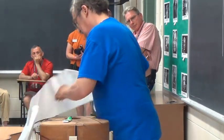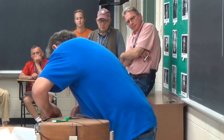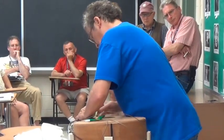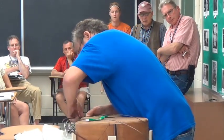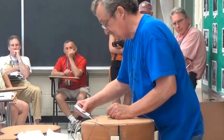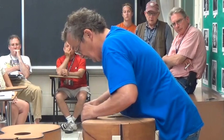But now, watch how easy this is. Now I'm working in what I call my push-pull mode. My bottom piece moved on me, but now with that tape there, see how I can work that right in there? And now all I'm going to think is down and in. I put the tape on the side, and I'm actually squishing, and you can watch. In a way, we kind of have a hydraulic cylinder here, so we're getting the glue to come out. So you're gluing the individual layers? Yep. And if you watch this, now it just goes real easy. I'm going to go down almost to the waist, because I can pull. Because if I can pull in tension, I can get this to fit my groove properly. And coming around the curves is the hard part.